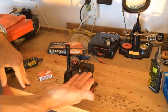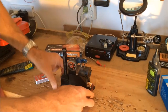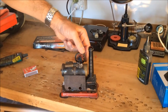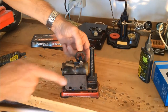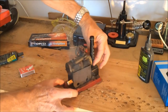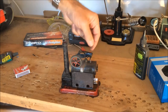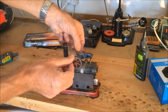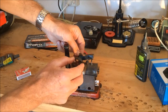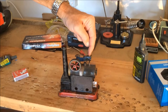As that heats up, we're going to boil the water and create steam. You can see this little pipe here that takes the steam into the cylinder. This is the cylinder — this is what makes the steam engine work. When I turn the flywheel, the cylinder rocks up and down. When the cylinder is in the up position, there's a little hole in the front of the cylinder that aligns with the steam pipe so steam can come in. When the cylinder is in the down position, that hole aligns with the exhaust hole so steam can come out.